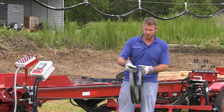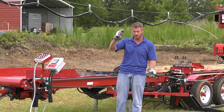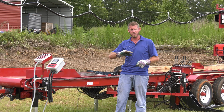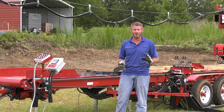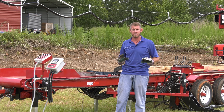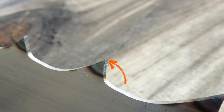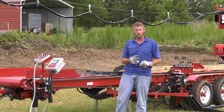There are several things that have to be just right on this blade for it to saw straight, and that's what we're after — a good straight cut. The blade's got to be sharp. The tip of the tooth is what's contacting the wood, that is what's doing all of our cutting. About the top 10 thousandths of that tip is what's making contact with the wood. That's what's pulling the sawdust out.